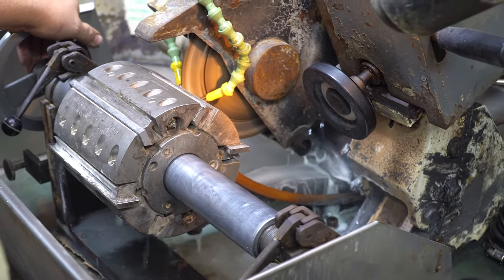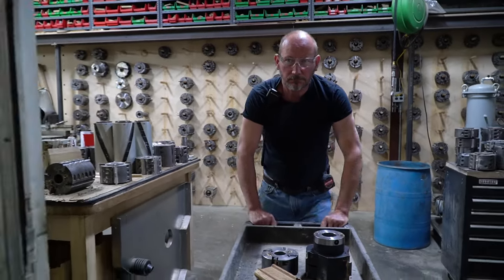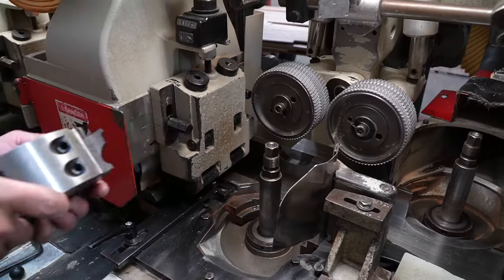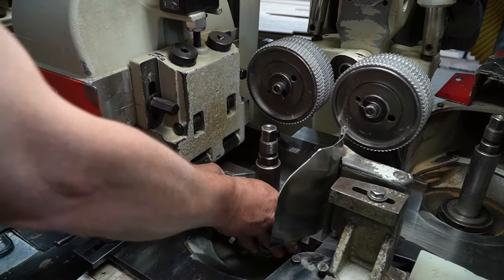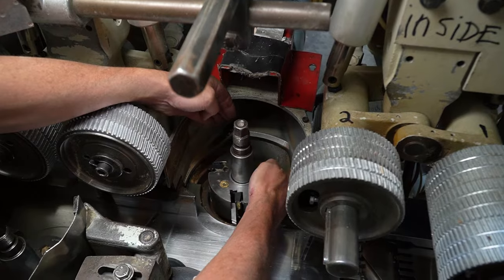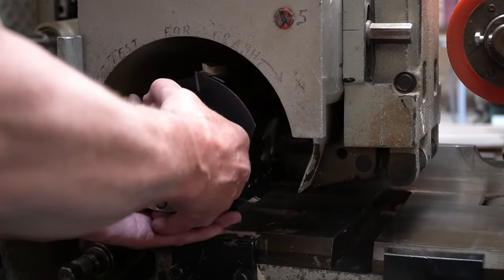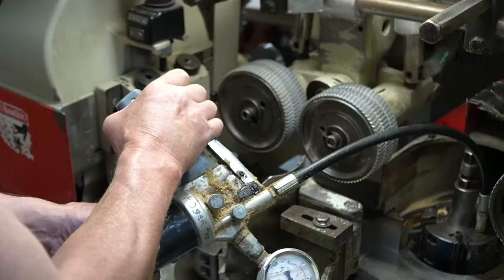The tooling's all made in the grinding room with Roger. He puts it all in the head for you and I take it out to the machine and we put the heads on the machine. There's three heads for this profile — the top head and the two side heads, the inside and the outside head. That's where the profile on this one will come in — the two side heads, the angles of the crown. Then you've got a top head which is a roughing head, and then another top head which is a finish head, and that will be the profile on the crown.